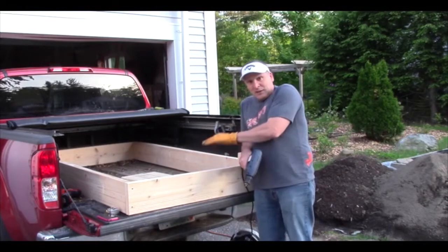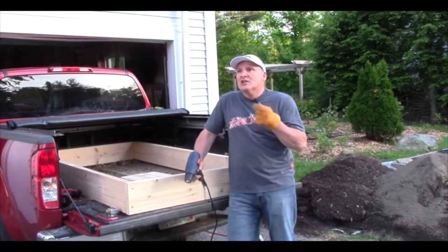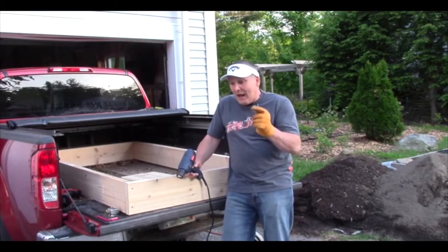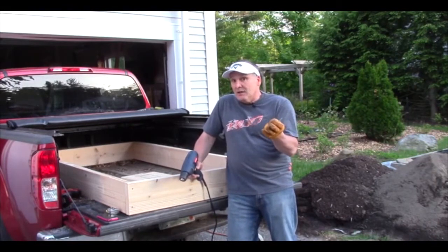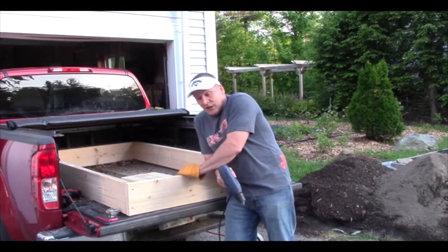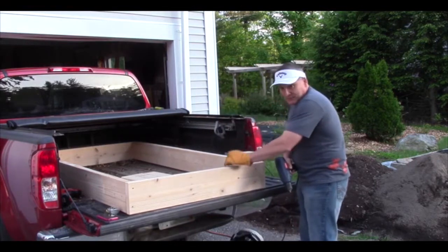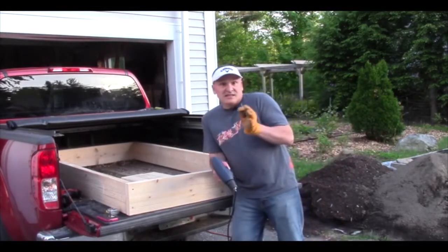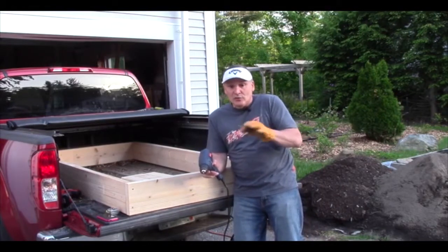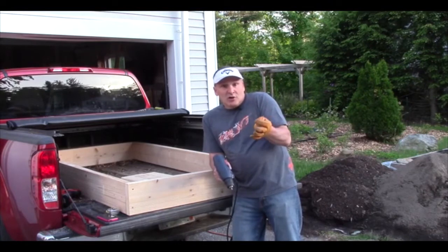Speaking about the environment — notice that I'm just using straight pine. It's pretty cheap stuff. Don't be using pressure-treated wood. If you're thinking it'll last longer — that stuff's loaded with chemicals. You don't want that leaching into your garden where your food is going to grow. Now, if you want to pay a little bit more, cedar would be an optimal wood — it would last a little bit longer. But even this pine, it's a soft wood. You're not going to be moving this thing around all the time. Once you get these corners to sink into the ground and the box is held together solid, this thing will last five, six, seven years easy. Just don't disturb the box — you can move and condition the soil year after year, and there's no chemicals coming out of this wood leaching into your vegetable garden.